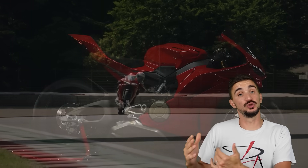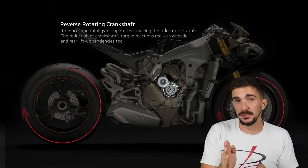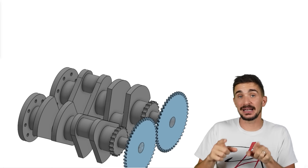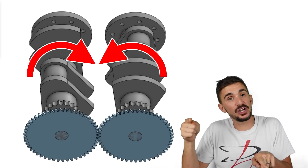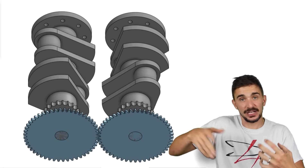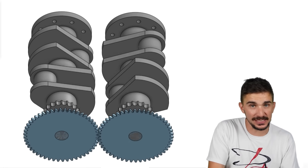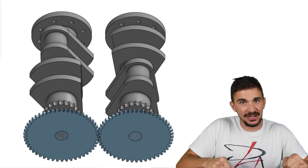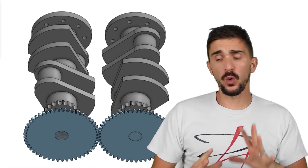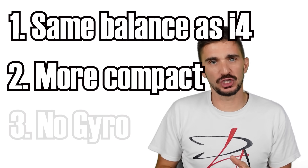This effect is slight and only really noticeable when the bike is ridden at the limit aggressively. That's, for example, the reason why certain Ducati V4 motorcycles have a crankshaft spinning in the opposite direction of the motorcycle's travel. Now, in the square four, we have two crankshafts geared together, which means one crankshaft spins in the opposite direction of the other. The gyroscopic effect of one crankshaft cancels the gyroscopic effect of the other, leading to a net zero gyroscopic effect on the motorcycle — meaning better steering feel, more agility, and easier lean when riding hard at the limit.